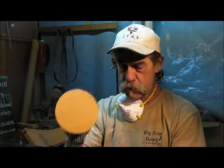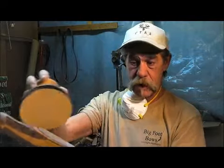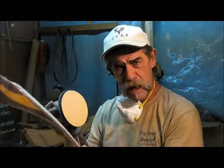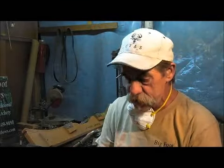I mean, they do a pretty good job, but you can't wiggle. And that's why I don't ever sand the edges of my bow with this, because these take a little getting used to. They sand a lot quicker. You get your weight down quicker. You can get a bow tillered in half the time. You can also screw up your bow real quick with one of these things if you start playing around and using them too much or standing in one area.